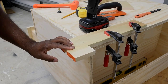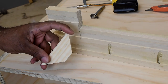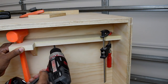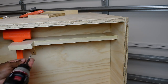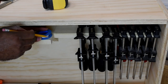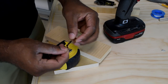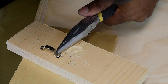One side of the rack will be supported and the other suspended, so I cut two 45-degree angles on a piece of wood and use it as a bracket. After looking at the rack, I decided to round off the corners — use a jigsaw or handsaw, then sand to the line. Looking around the shop, the best thing I found for holding my measuring tape was a picture hanger.